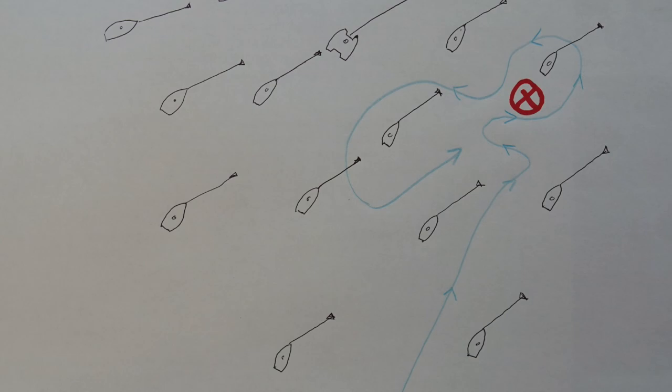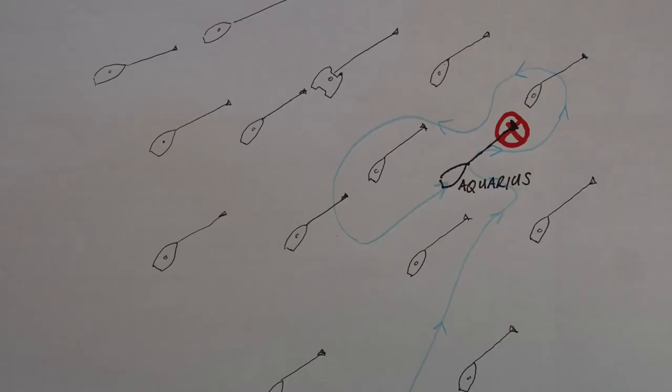If I came into this anchorage from the south, I would choose my spot — let's say here. Then I would weave in and out of the boats, watching the Echo Pilot to make sure the bottom is good. Then I make my way to the final approach, which is always straight upwind. I drop the hook and wait until there's enough chain out that the anchor is sitting on the ocean floor, then start my reverse. Aquarius ends up just about here, and that's where I want her.